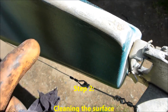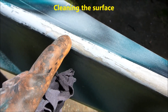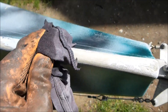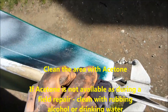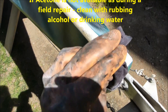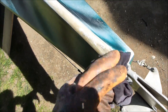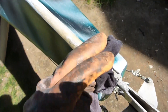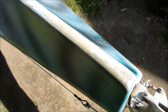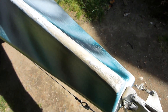Here's the area I prepped — I sanded it all back to the nice gel coat. Up in here there's still some gel coat left, so as it's wearing through the gel coat it's wearing into the fiberglass. I have some acetone on a rag and I'm going to clean it up. What roughing it up with sandpaper does is ensure the resin and fiberglass give a good mechanical bond. Washing it down with acetone provides good chemical adhesion between the new fiberglass and resin and the old materials.